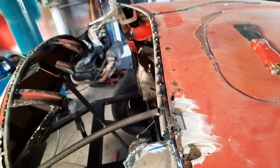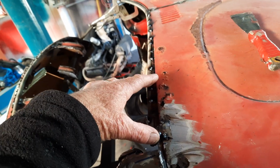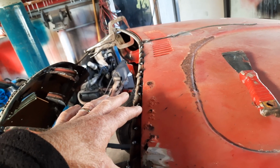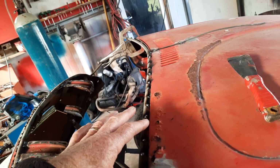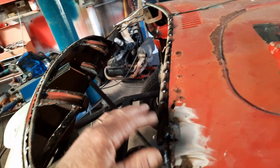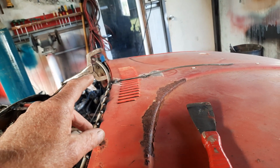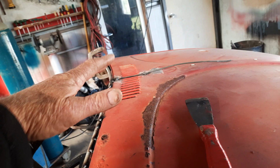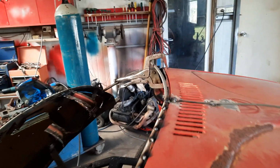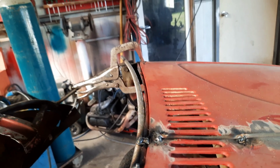So, anyway, when I finish getting all these bits, I'll be able to just put it on the ground, put my foot on it, and bend that into shape, but it's really difficult to get both sides right, and then tack it on. So I've got one side right, I've tacked it on, and now I'll have to put heat onto the other parts of the rod and get that to fit. Actually, I can see I haven't even cut that edge very straight either, so I'm going to have to trim a little bit off that edge first.